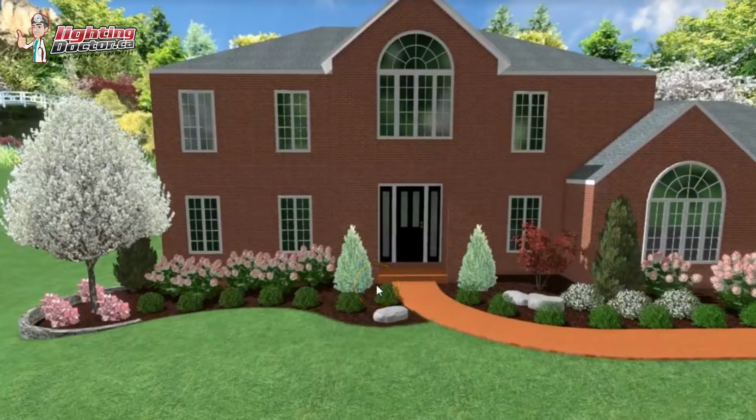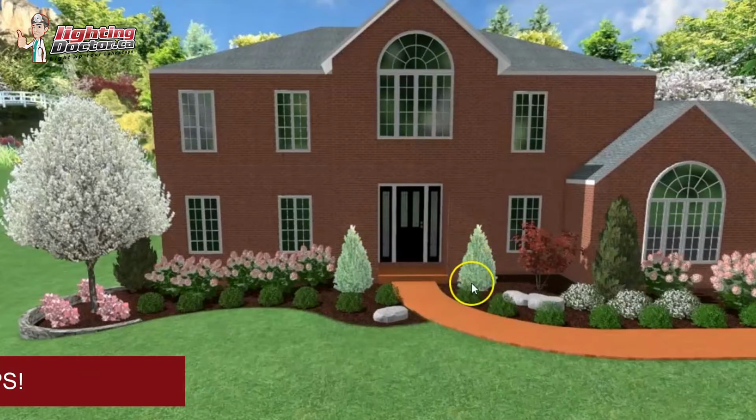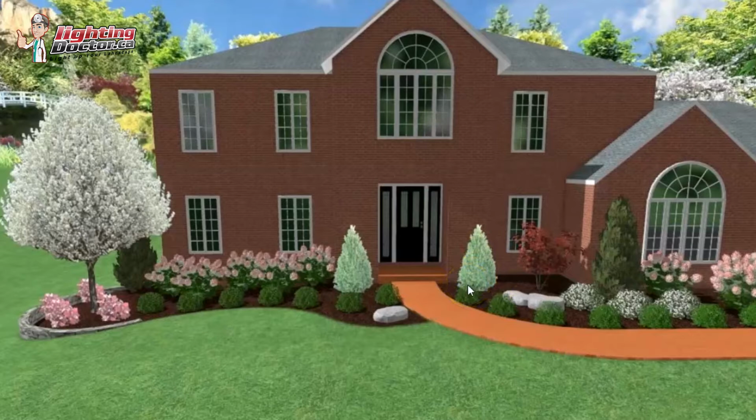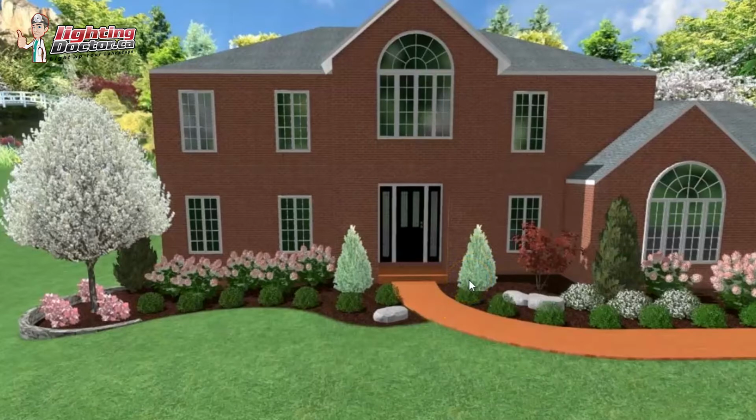And the way I would do it, I think on this front section here, if these haven't been planted yet, try and give yourself some room behind them, at least 12, 18 inches, where you can have one of those uplights on both sides of the entryway here that are just washing the brickwork right up to the top peak. That's why we want those higher lights, because we really want this whole area to stand out, because it's right by the doorway area too. That's why I like having it a little closer to the house behind that tree, because it hides it a bit, so you don't see the fixture. You don't have that side glare in your eyes. So if you can get that light behind these, would be ideal. And then it does a really nice job of making the entryway pop.